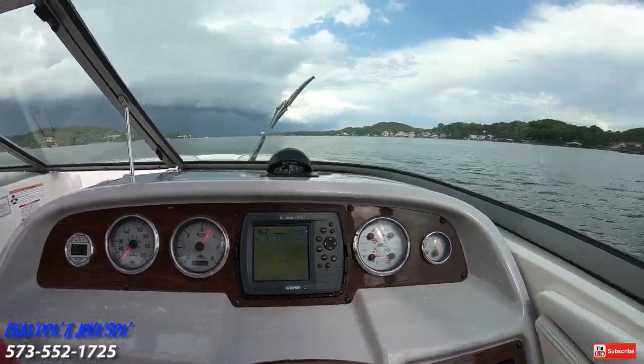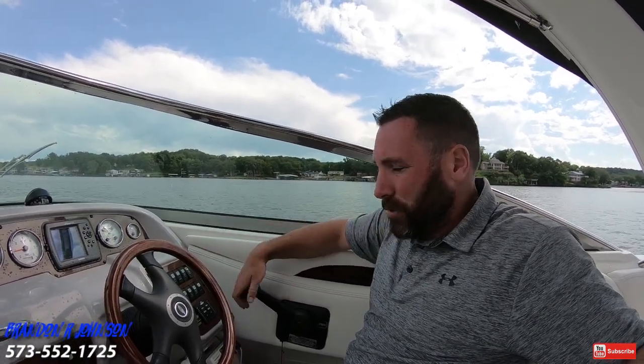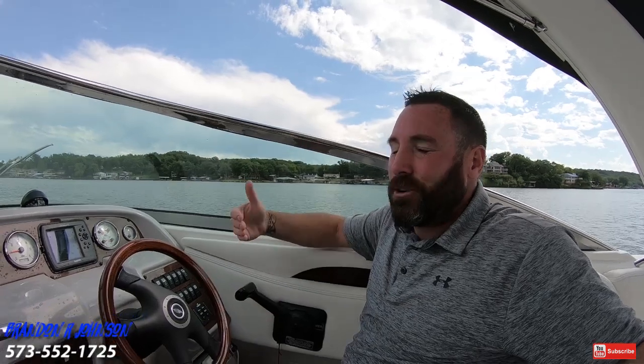We're going to talk about how the trim tabs work. So trim tabs. A lot of people get excited to have a boat with all these new systems. And it might not be new to you to have trim tabs on your boat. So I always tell people when you're getting something new to you, break it down. Don't touch the tilt and trim until you're used to how the boat feels, operates, and maneuvers while trimmed all the way down. Unless you're a trailer boat, or you trim it up so you don't drag it on the ground. But once you get used to that, then you can play with your tilt and trim up and down. Once you get used to that, then you can play with the trim tabs.